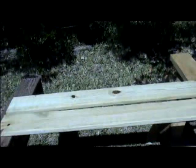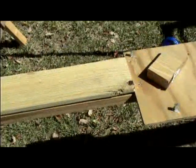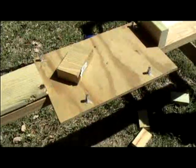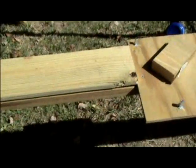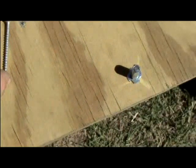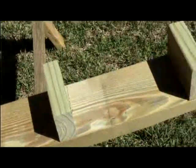The next step is to cut the 5-quarter radius edge deck board into two equal pieces — cut it in half and square the ends. Since my 2x6 was two feet longer than the 5-quarter radius edge deck board and my plywood was not two feet wide, my 2x6 was too long. So what I did, after I cut my 5-quarter radius edge deck board, I laid it from the plywood to the end and cut the end of my 2x6 flush on both ends. In the next step, I used two-and-a-half-inch coated deck screws to screw my blocks down in equal increments on both ends of the 2x6.